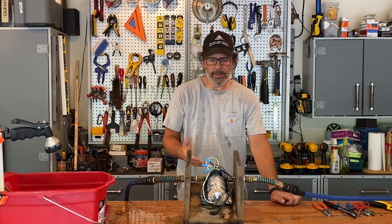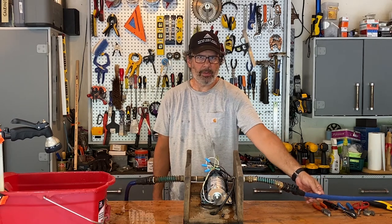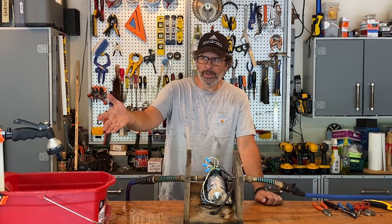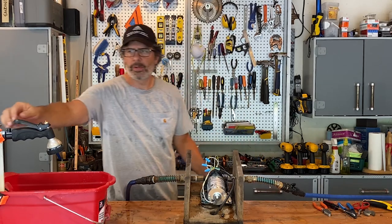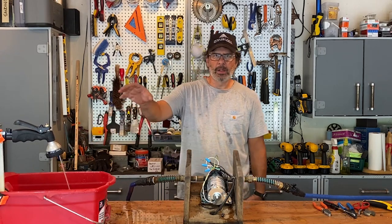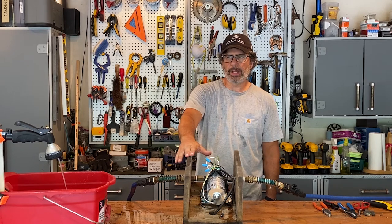So I have the pump, it's in the powered on position. I have my 4 pounds of pressure coming out of the rain barrel here just from my gravity feed. And then over here, I have my makeshift version of my garden irrigation system. 8 o'clock in the morning, that timer clicks on, opens the valve, starts watering. And as that water pressure that was in the line starts to draw, the pump just kicked on. You can hear it running now.